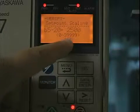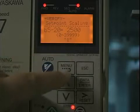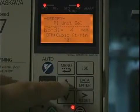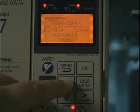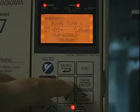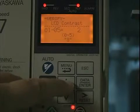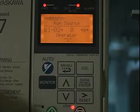We've got this configured to take an internally sourced PI setpoint which is 900 CFM. We've got setpoint scaling — for this transducer it's a 0 to 2500 CFM transducer — and our units displayed as CFM on the display. We've also got an accel and decel time set up a little more aggressively than factory default.